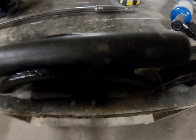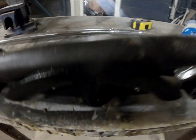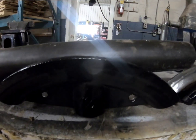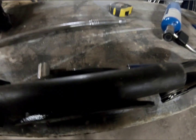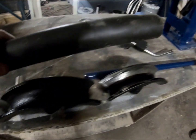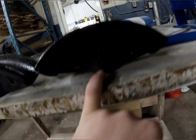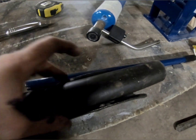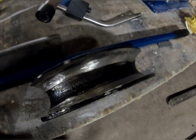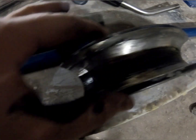Moving down, this one is an inch and a half, and this pipe is an inch and seven-eighths, and it fits with play. That's the difference between pipe and tube. I was using this one at first and it was kinking them really, really bad. So what I ended up doing was making my own die — I made it from an inch and a quarter up to inch and seven-eighths. I had to grind, test fit, grind, test fit for a couple hours and make it the exact same size all the way across.